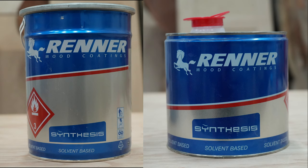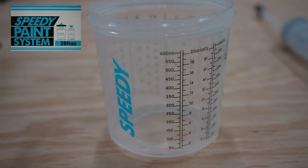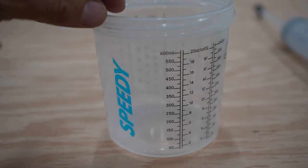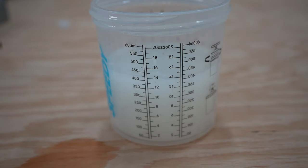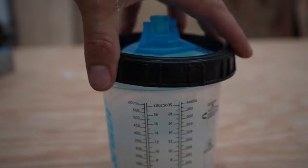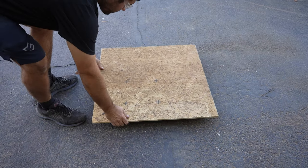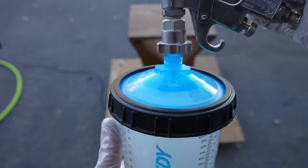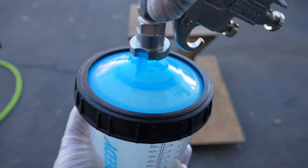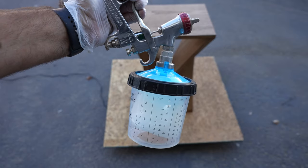Then I prepped for a two-part spray-on finish. I'll be spraying this with a high volume, low pressure HVLP gun. This speedy system really lives up to its name. Add a disposable cup to the outer measuring cup, then add enough of each of the parts — for me that's 10 ounces of the finish, two ounces of the hardener, and two ounces of thinner. Then install the disposable lid, which connects it to the disposable cup, and add the threaded ring that holds it all together. I shake it up to mix it and add a plug to the top. Then I head outside, set a platform on a turntable and set my project on that. This allows it to spin around instead of my hose getting wrapped around it as I try to walk around and spray the project. The cup just slips onto the gun and a simple twist locks it in. I keep it upside down and pull the trigger and you can see the cup collapses as air is pulled out, making it so I can spray at any angle.